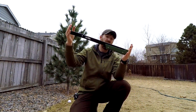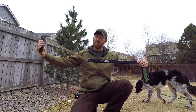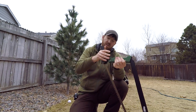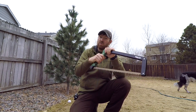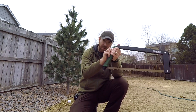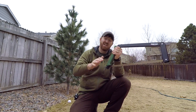So here we are with the Bow Reel 21 — very simple to set up. You just swing your green arm, or orange or yellow depending on the option, and this guy comes around. There's a little slit that you feed your blade into, and then it's just tension right here at the end. Make sure your hand is out of the way because it will snap. You're snapped into place. Now to take it apart, be really conscientious because of the friction — if you pull this without paying attention it will absolutely swing that blade around. Make sure no one is standing near you, and hold it securely as you pull the tension off, otherwise it'll swing right open and you could nick yourself or hit somebody nearby.